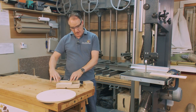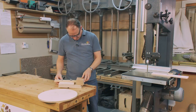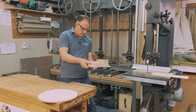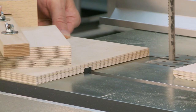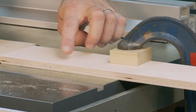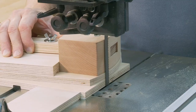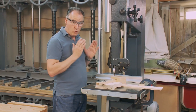I've got a baton we've made up which is connected with wing nuts, pre-mortised - this sits onto the jig. We need to get it lined up so it's in the right position and then get the wing nuts tightened down. I've got it set up so again the front of the teeth are on the centre of our circle, and I've got a stop block on the back just G-cramped on. We push up to the stop block and then just rotate it around to make the cut - the idea is we could make a hundred of these and they'd all be exactly the same.